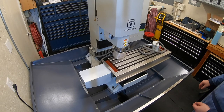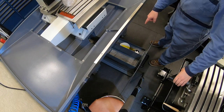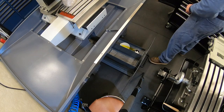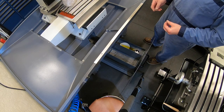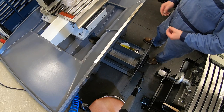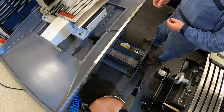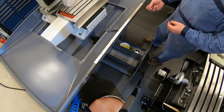And the other thing that I need to do, I know it's a little hard to see there, but on the bucket that goes for that oil skimmer, there were the little hold downs. I ended up not using those in the other video. So two things. One, Tormach does have a set of instructions for that. If you Google it online, it comes up really well, and it's a pretty easy one-pager. But they do want you to put these little bolts and the clamps on there to hold it down.